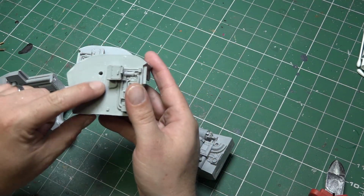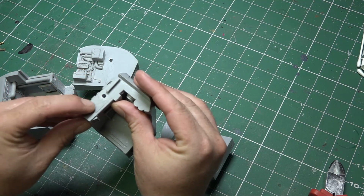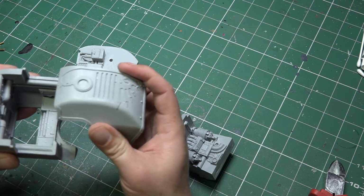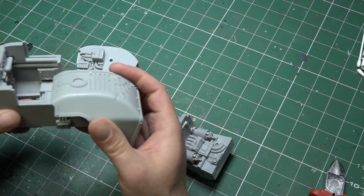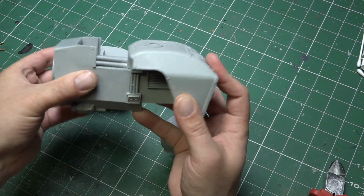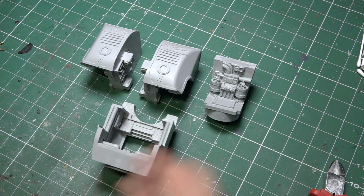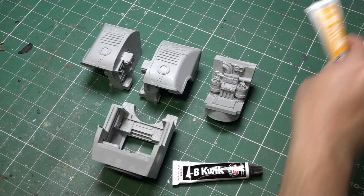Remember, you've got to make sure that you line up the pieces as a dry fit before you do that, because you want to make sure that only the area you're going to be applying adhesive to, and not any of the detail that's going to be exposed to the paintwork, has that keying. So with all the prep work done, we are pretty much ready to crack on with the JB Weld.